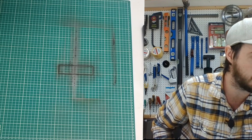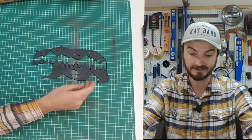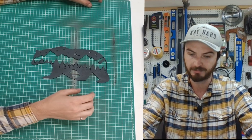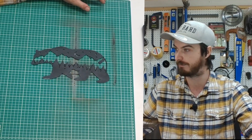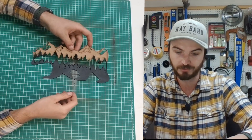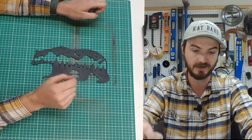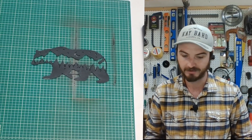Then I started to get into something a little more on the retail side of what you could sell — we put together this bear. It has a lot of fine details: all the tree branches, some smaller grooves down low — everything cut out super precise. The stars are very sharp. This one did cut all the way through on two passes, and there was no issue popping out the centerpiece. All those small grooves had no issue just falling out of those slots. Doing two traces over this, there was no misalignment — it was right back on the exact same line as the first time. I do make sure not to bump the table while it's cutting. Very precision cut.